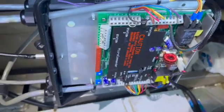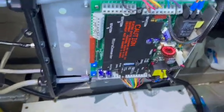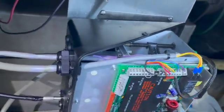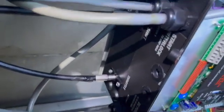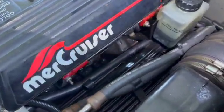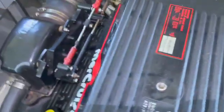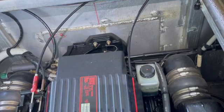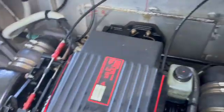What it is: you have 12 volt coming in — if you see the wires coming in on the top and bottom, those are the 12 volt systems — and then all those other wires are the controls that are inputted. The other cables on the backside: one is throttle and one is shift. Those cables wrap all the way to the motors and go back to here. You've got your throttle cable on this side and your shift cable on this side. We replaced them with new shift cables and put new ones in. We also sent that box out to get it repaired.